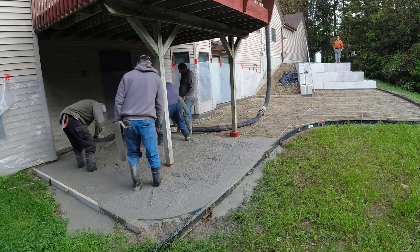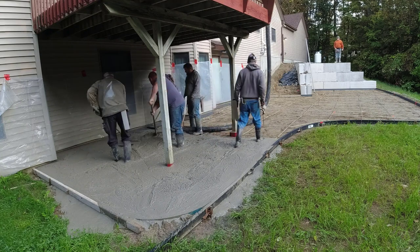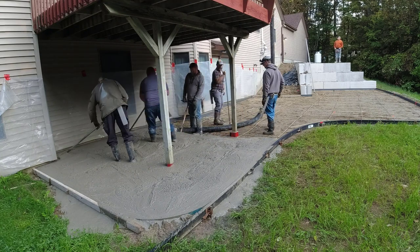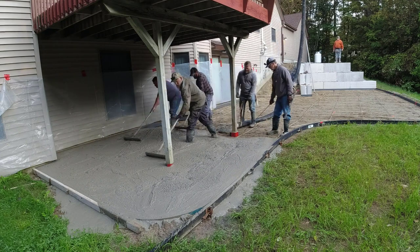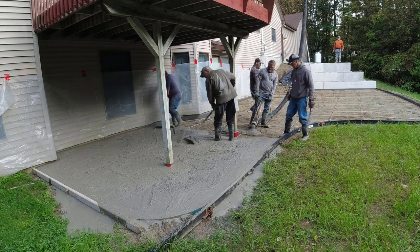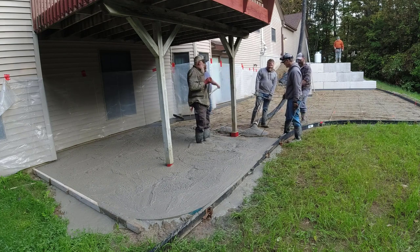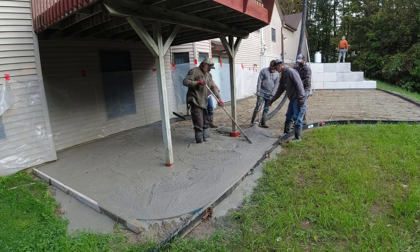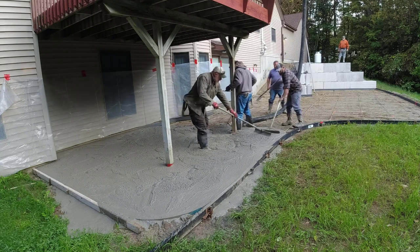In the beginning you always get a little bit of that loose watery cement — you just spread it out and get rid of it. That's kind of what went under the forms; we'll clean all that up after we strip the forms. We decided to get rid of it on the inside of the forms today rather than pump it on the outside and pick all that mess up later.